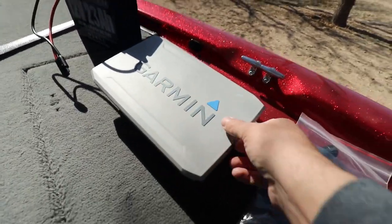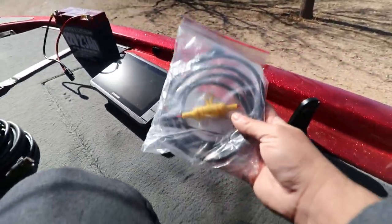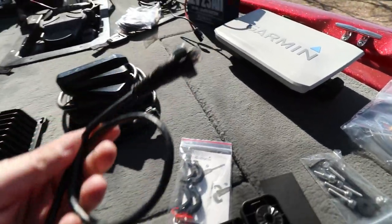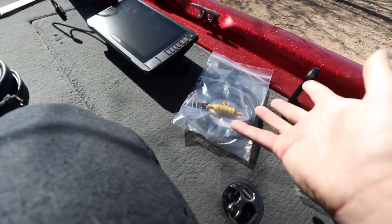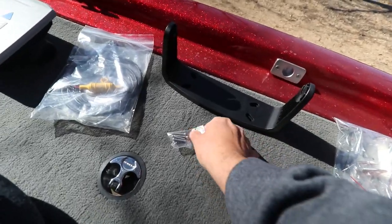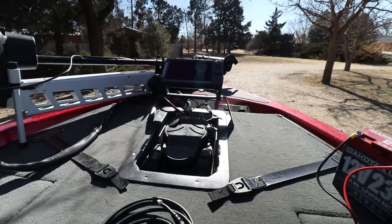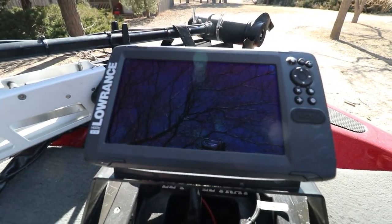I'm using the same fish finder — it is compatible with the LiveScope system. I had to order a new power cable for that and also a new cradle. Then you've got this attachment that connects to the fish finder; this mount will be mounted up here. Each boat will have its own mount and its own set of wires — it's just the screen and the battery that we're sharing. Also, you've got four screws to mount this as well. Here is the fish finder I have on the boat right now, so I'm just gonna get rid of this completely.